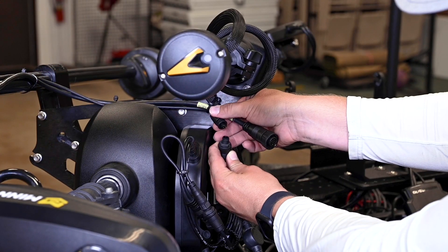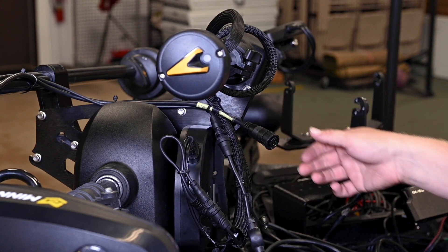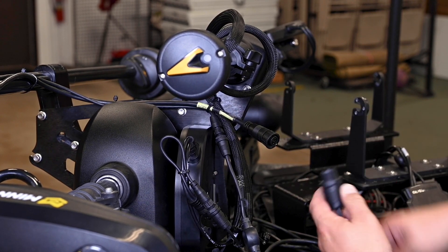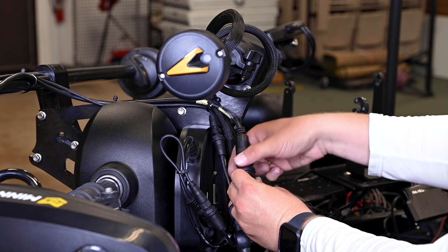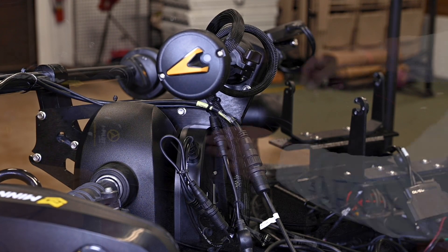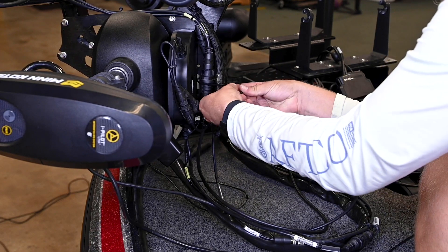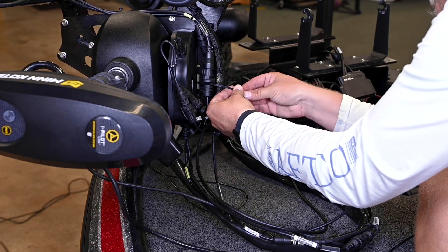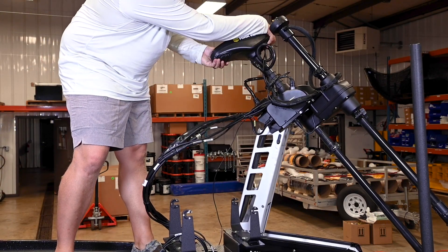Next, we will route the Mega 360 cables. Connect the power cables to the power cable connector on the pod shaft and connect the transducer cable to the transducer cable connector on the pod shaft. The connectors are keyed to prevent reverse installation, so be careful not to force the connectors. Hand tighten the screw nuts on each connector. Rotate the cables to the side of the trolling motor over the bow to the chosen connection location. Leave sufficient slack in the cables to allow for full movement of the trolling motor during normal operation.